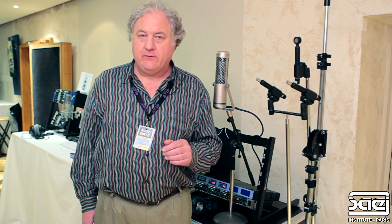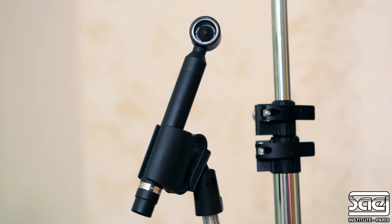We also have a fairly general purpose cardioid microphone — that's the C42, and it's very popular. There are stereo matched pairs and single ones. We also make a single cardioid microphone intended for very close-up, high sound level applications — the E22S, which is similar to the C42 but with a different design capsule specifically for high sound pressure levels and use very close to the sound source. We don't want the directional pattern or the timbre of the pickup to change with distance. The E22S is optimized for that sort of close-in recording.